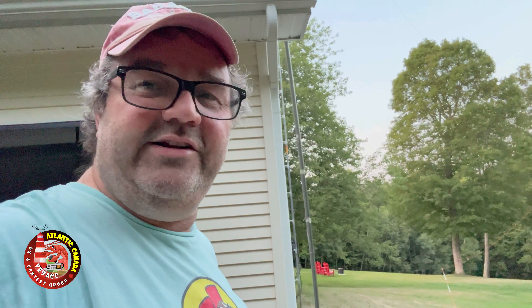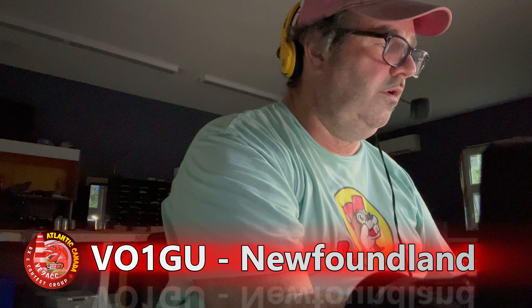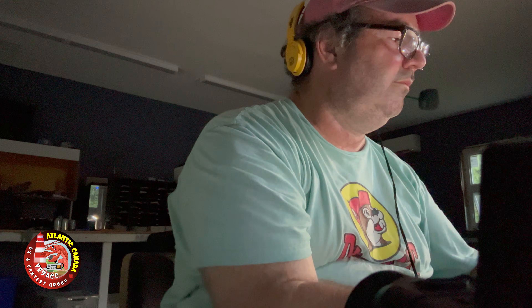So all the hype about the Pota Performer — even in bad band conditions, I was making contacts. The next test: let's see how directional this thing is. Now I have it pointed in my usual direction towards Europe. Let's see if we can pick up more Europeans. This way is towards United States, that way is towards Europe. Don't worry if it's getting a little dark in the shack — it's getting close to 8:30 at night and I don't like to work with the LEDs on. I was only running 50 watts on that last test; now I'm up to 100 watts. Victor Oscar 1 Golf Uniform, you're 5 and 9 plus 20. You're into Newfoundland, Canada. I'm just running my brand new vertical antenna, the Pota Performer, and I'm happy to see it's getting out well.